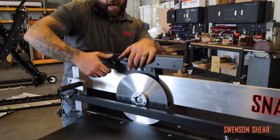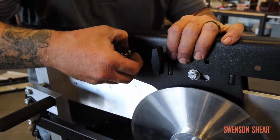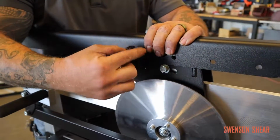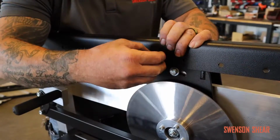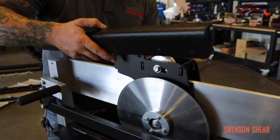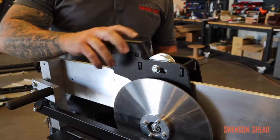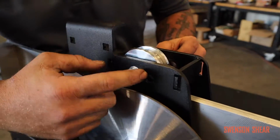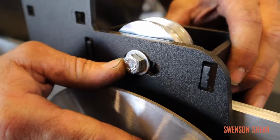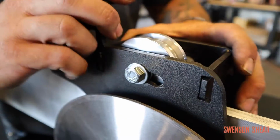So what you want to do is take your handle off, remove your nuts or your T-nuts and your 3 washers off each bolt. Set those aside. Remove your carriage bolts. Set that aside. So what's going on, the reason why it's wobbly like that is this slotted hole on your carriage is made for an adjustment so you can adjust your tightness. If that gets loose and comes out of square, you'll get that wobble.